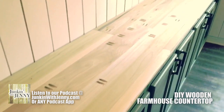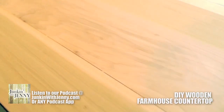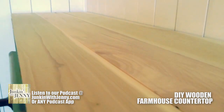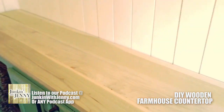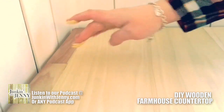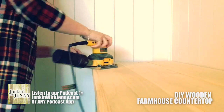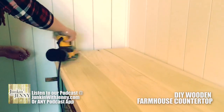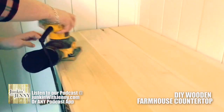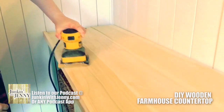Then from there, you flip it over, so now you have the nice smooth side down. You can see it's looking real nice, all coming together really smooth. Of course, you're going to have a slight variation from here and there on some of the wood, so what we're going to do is fix it down, then sand it. Sand it real nice and evenly — do a rough sand, then a smoother sand — and get all those small divots out that you might have between the boards.